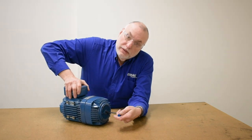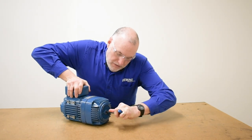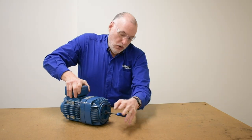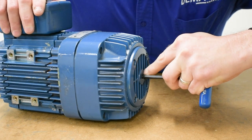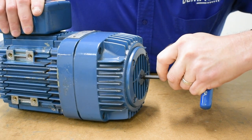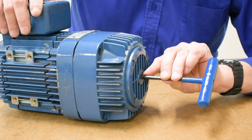Let me show you the concept of the measurement. On a motor that's not energized, we'll use manual pressure to push in on the end of the motor shaft. We allow the spring to kick it back. When we're pushing in, we butt the rubber O-rings up to the back edge of the louver. We let the spring return and the distance between the O-rings and the back of the motor is the actual axial displacement measurement.